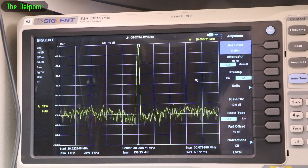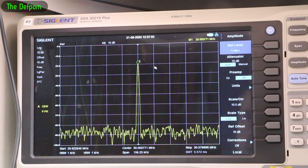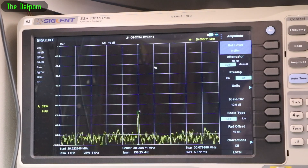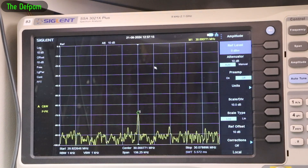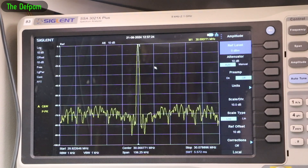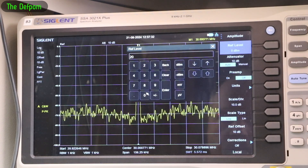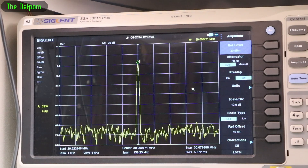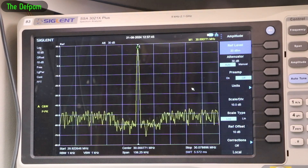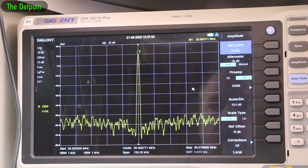I've changed the scaling on the SSA and added an offset for the 10 dB attenuator so we can see real-time scaling. Stepping through: 0 dBm, minus 10, minus 20, minus 30, minus 40, minus 50, minus 60, minus 70 — which is as low as this unit goes. That is looking bang on according to the SSA, it actually correlates. Output looks perfect. Going up to 20 dBm: 0, 10, and 20 — perfect. Can also do smaller steps like 15 dBm. It works perfectly, no problems at all.